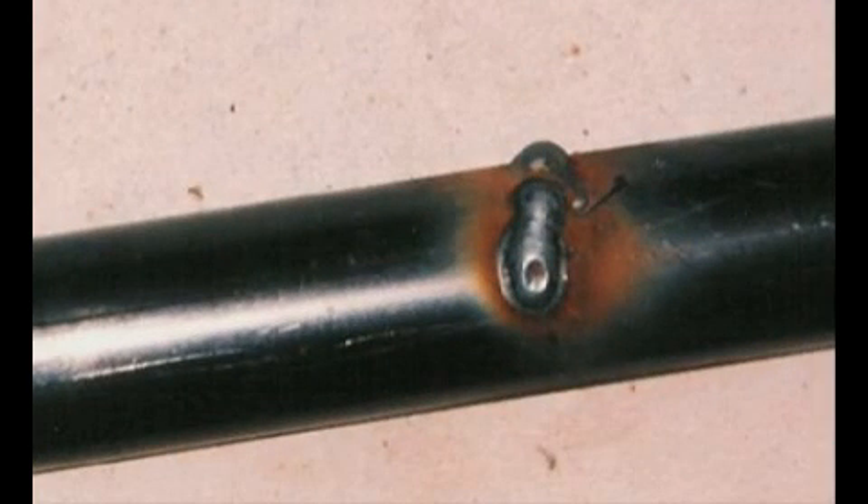Having visited a heavy equipment manufacturer and watched them correcting distortion with MIG straightening, I tried it. The advantage of using MIG is that the shrinkage is very repeatable and predictable. After five small weld beads properly placed — checking after each one — the needed dimension was achieved.